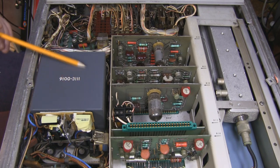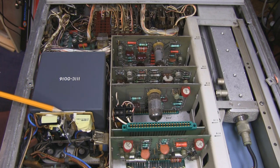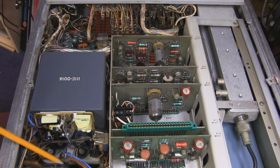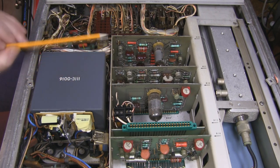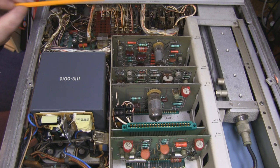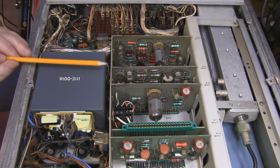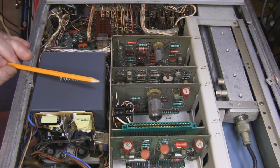We can see the bottom of the big transformer on the power side. You can also see my little hack where I put a small power supply in there, tied directly to the 240-volt rail on the on/off switch, just to drive that DC fan and make it a lot quieter. That DC fan spends most of its energy cooling those big two valves on the power supply itself. This unit would have cost a fortune back in 1966 because all of it would have been constructed by hand - all the wiring looms made up and soldered directly to the distribution boards. So a lot of labour went into building one of these and the cost would have been astronomical. A hobbyist definitely would not have been able to afford this in 1966.